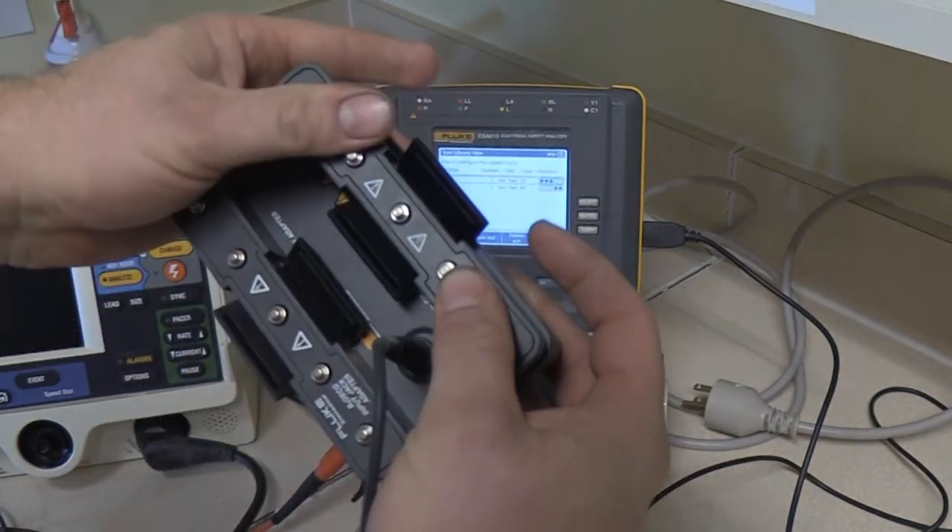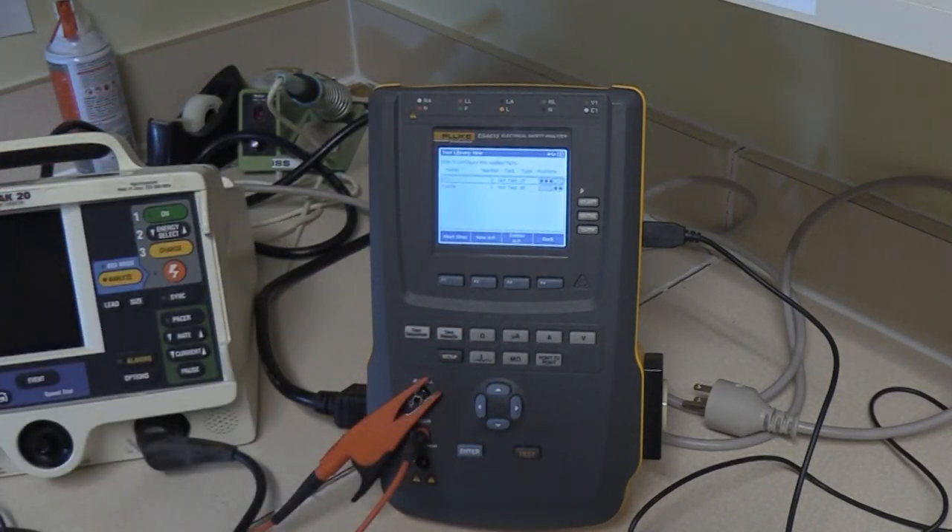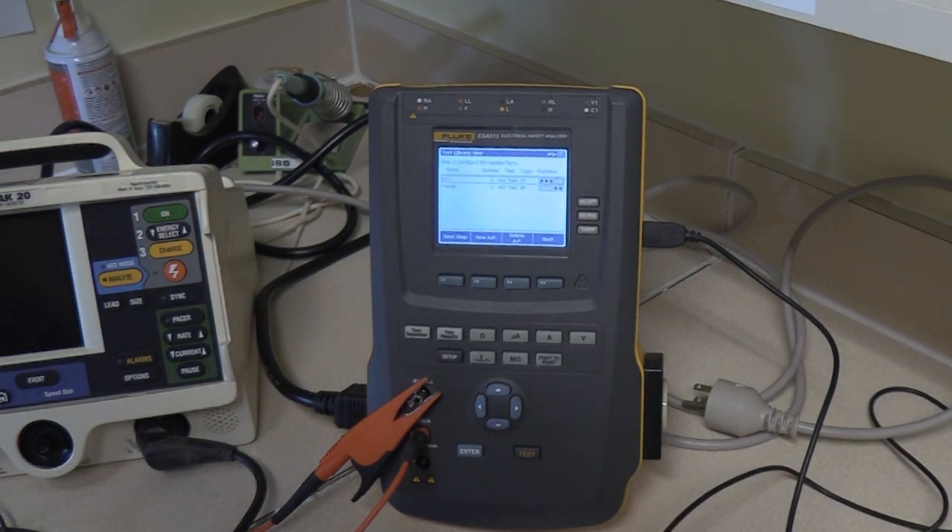We'll put this other block on here. What this allows us to do is connect 10 ECG leads through one port — it bars them together. So we're going to delete this step with F3, confirm yes, and create a new step with F2. We'll title it ECG 1-to-10 because we're going to use the 1-to-10 adapters, with patient connections set to 1 since we're only using one port. We're going to make them tied — that indicates all those leads are tied together — and the type is BF. Hit F1 for done.